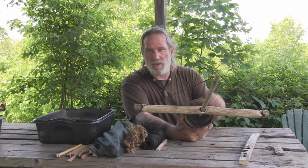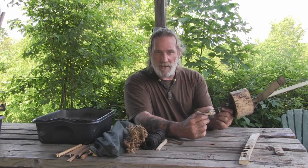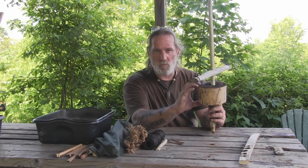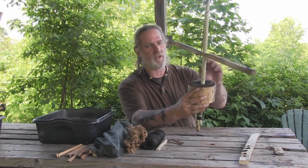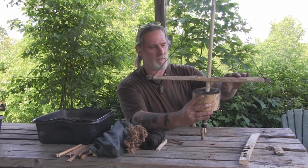But I think that this chuck system is going to work perfect for me. I think that this interchangeable bit in and out is ideal. And I think that this is plenty heavy. I was afraid this piece of pine wasn't going to be heavy enough for a counterweight, but I think it's plenty heavy. And I think you also have to make sure that you've got good free travel on this upper part, and you also have to be sure that while you're doing it, you're keeping this thing even, because if this thing becomes uneven for some reason on you, that's going to cause you a problem when you're going up and down. It's going to want to bind.